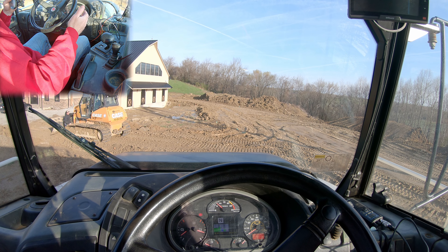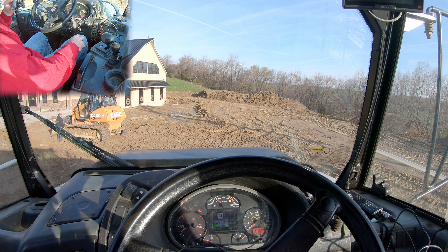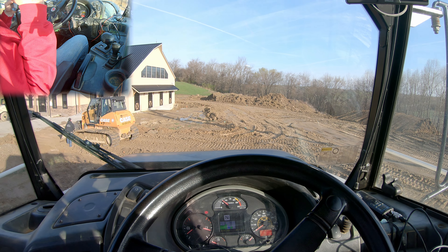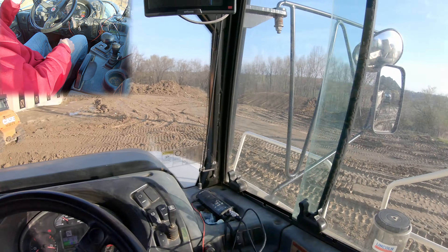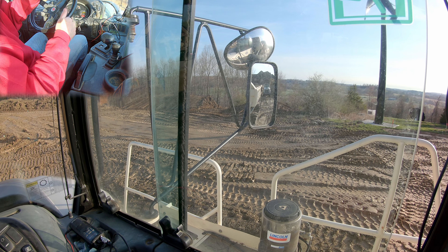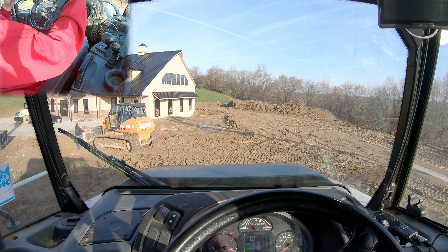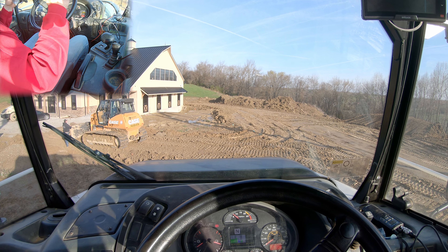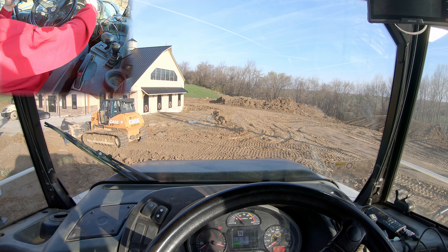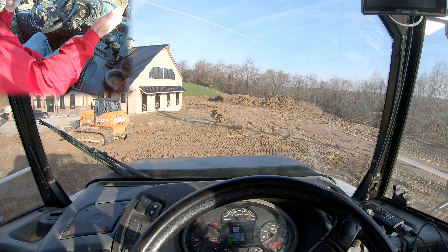Another tip: when you're backing up against another pile without a dozer, you'll get it to where your rear axle starts to climb the pile — there are two axles in the rear of this truck, two sets of wheels. When your rear axle starts to climb the pile, that's when you should dump. You can stack significantly more dirt in an area that way. Stack your piles tight — don't be the guy that leaves piles 10 or 15 feet apart, because you'll easily cut the amount of material you can haul in half before the dozer has to go maintain that area.